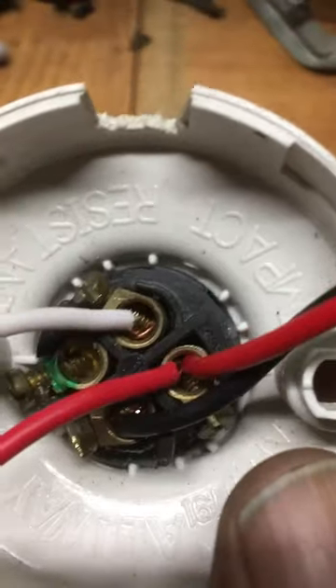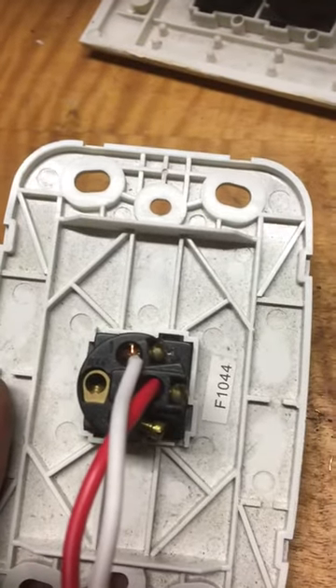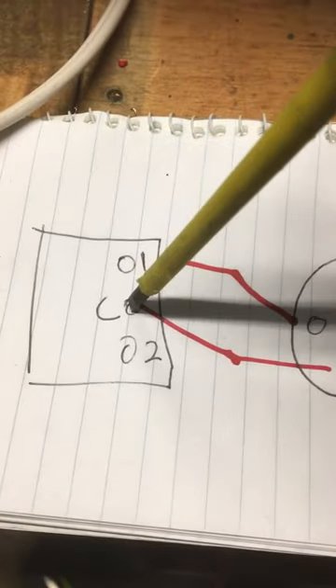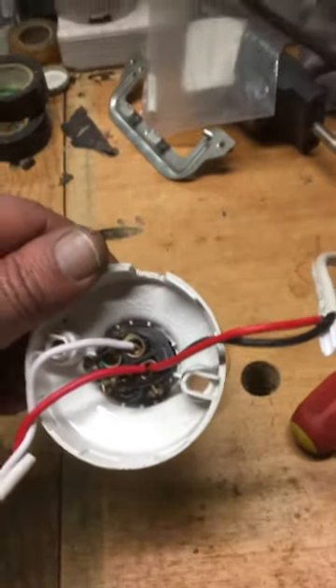Into your loop, out of your loop — just twin into your common of the switch, add a number one. The white wire goes back to the terminal of the light. On paper it looks like this: constant active to common, number one back to your load.